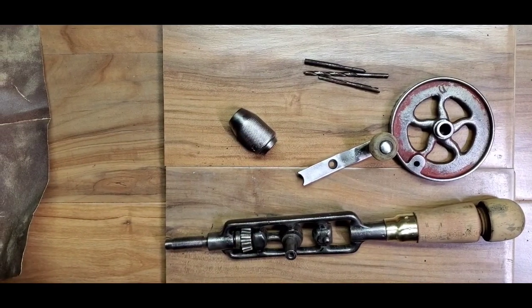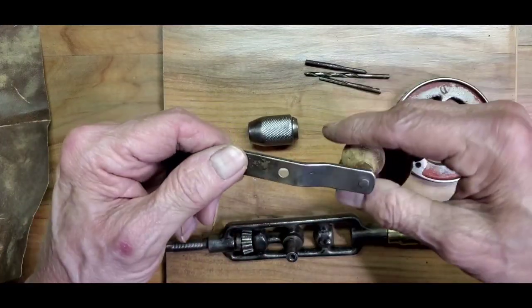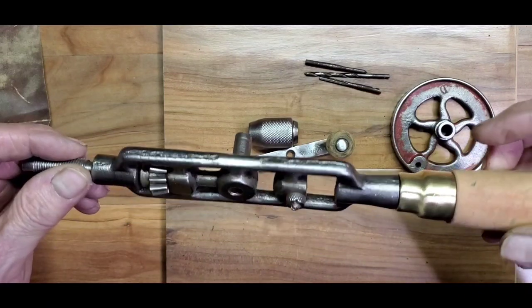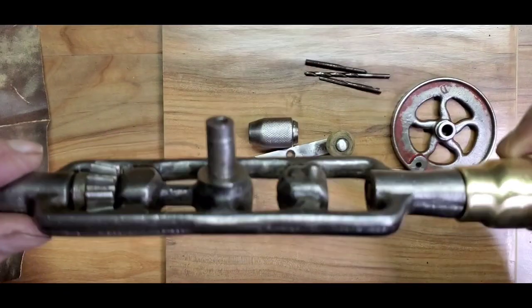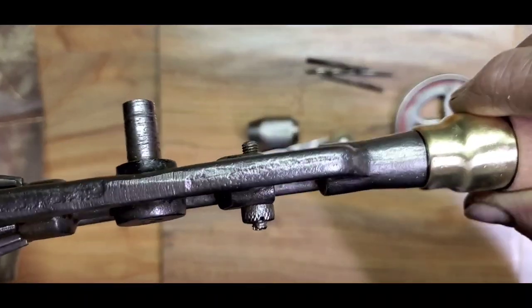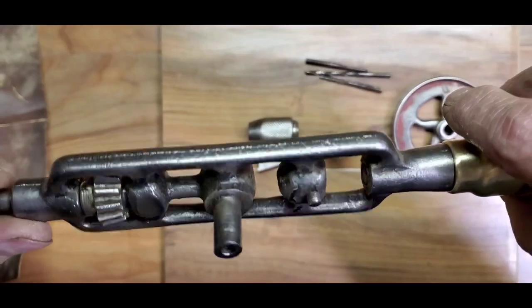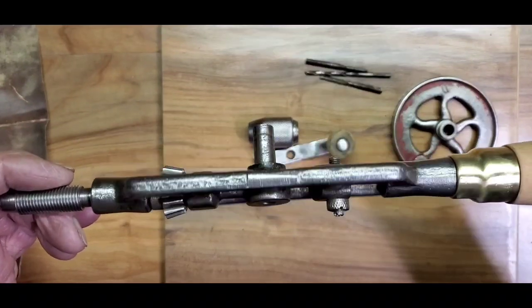Here's our post wire brush evaluation. The chuck cleaned up nicely with the wire brush. The handle cleaned up and polished. The wood's been sanded. The frame is clean. There's a nice brass ferrule on here. A couple of things to do — first of all, look at that terrible finish on the casting. That's one of those terrible grind jobs where they just gouged it and really did a terrible job. I know this item was painted, so it tended to cover some of that up. I definitely want to smooth that out, file it and sand it down before painting. Don't know what color I'm going to do this frame — I've got some done in a natural silver color and some in black, so we'll have to see.